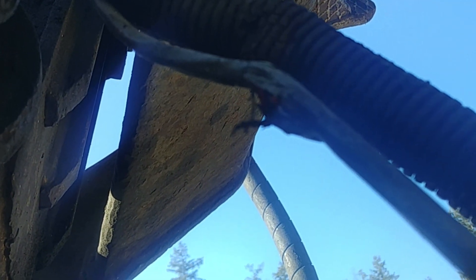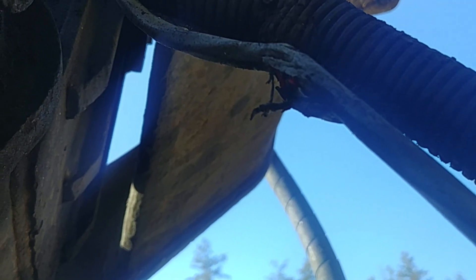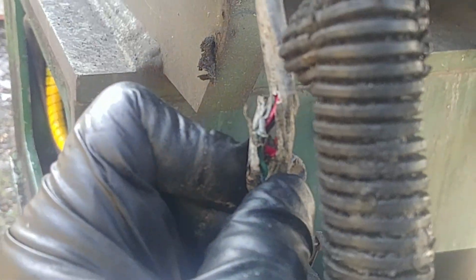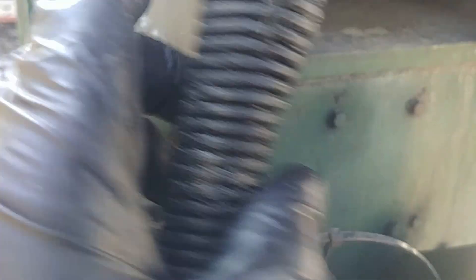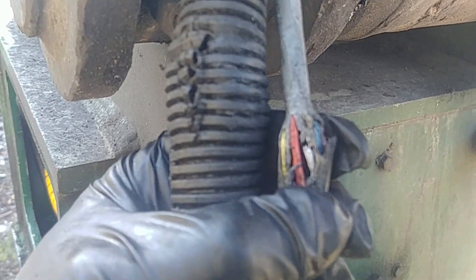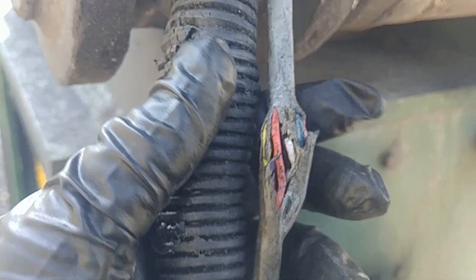The contact points of the harness against the sharp metal edges — probably when the grapple was swapped to a bucket or put back, it got jammed in between or something got on it. As you can see, we have an open circuit. Electricity cannot make a loop, and that is probably why the grapple stopped working.